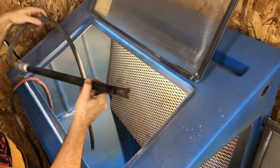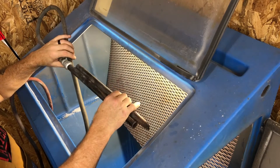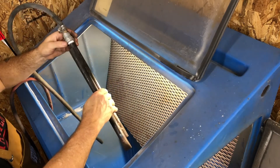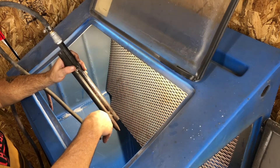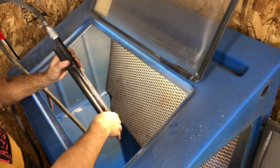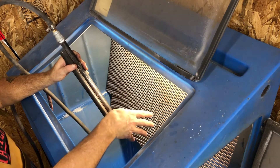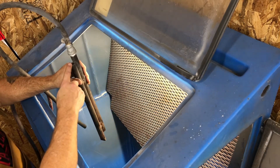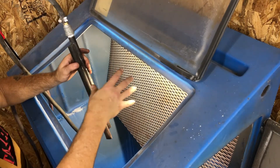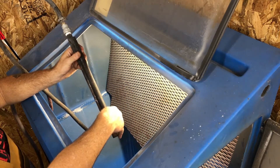I had done a video on making a better siphon tube for a sandblasting cabinet and it has worked very well, but I've run into two problems. One: using very fine grit material like 100 grit aluminum oxide, it has trouble keeping a consistent flow when I'm down around 30 psi. The other is it's having to pull from the bottom and just sucks a huge cavity.